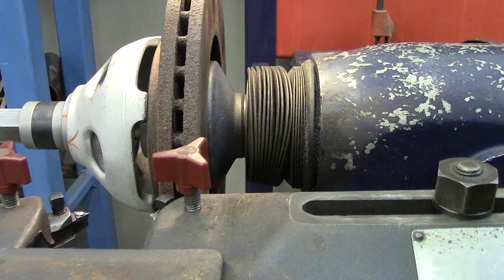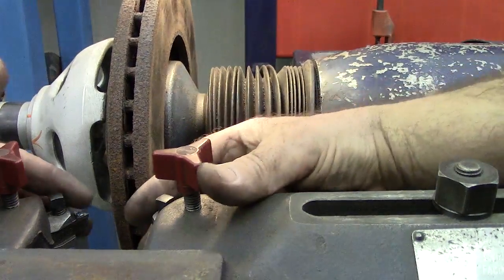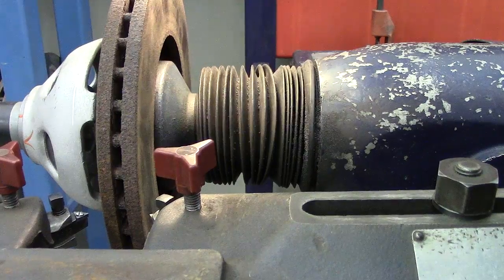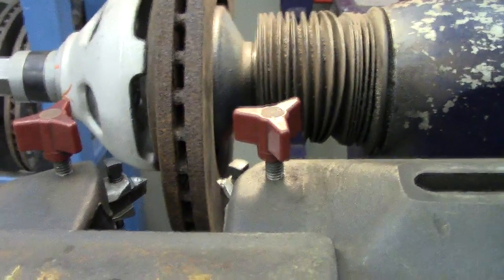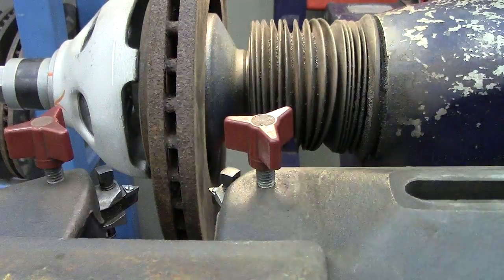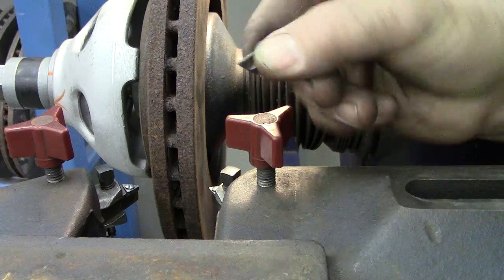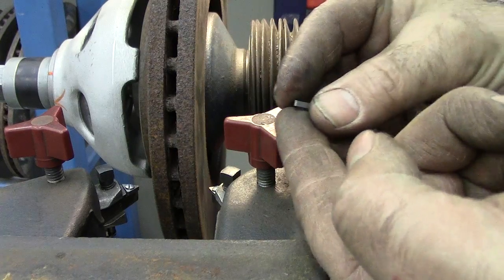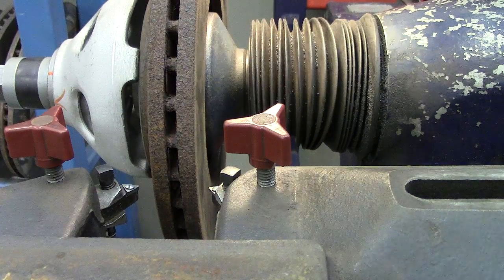Okay, next for cutting this unit, it's very simple then. I'm going to go to the very left handle and move this guy out to where I'm centered in the cutters. I've already backed off the cutters, pulled them back in. I'm going to center it up. And you can see the two cutters down here, with a little triangular cutter pad on them that is replaceable and reversible. We can actually reverse this guy, turn him upside down. There's one new cutter that has the carbide, and it's only that little skinny line on that little point that's making the cut. So it takes a while to get all that out there. We're not taking large amounts of material out at a time.